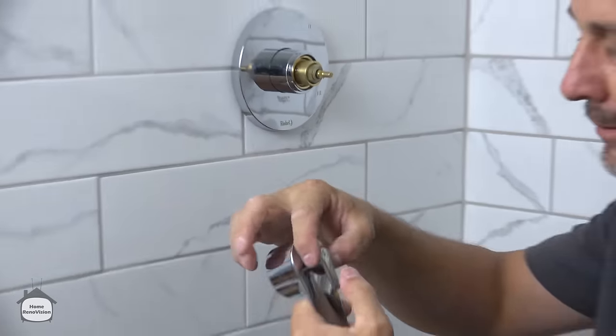Now remember, when we first put this together, I took a little measurement from the corner of the drywall over to where the 2x4 was, and I took a picture with my phone so I'd have a record of it when I was done, and it was 20 1/4. Now I am looking at 19 3/4. That's about my center line because it's thicker now than before. And I'm just going to put this green line here. Turn on my laser, bring that over to my tape line. All right, now we're in business.